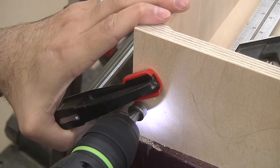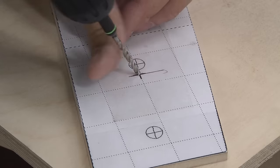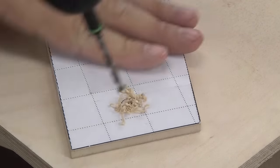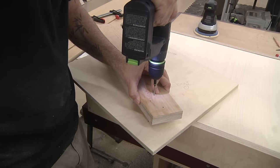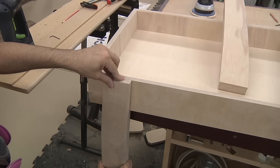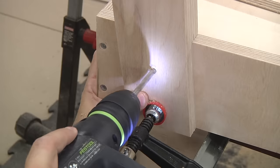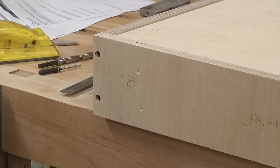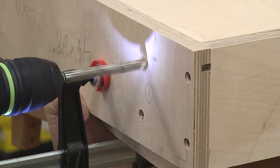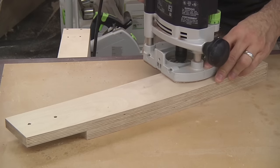Adjust for square and then pre-drill for two screws at each corner. Now let's attach the legs. First, drill a couple of small holes through the template where indicated. Place the template over each leg and transfer the hole locations using the same bit. On the table box, mark two inches in at the top and use that line to locate the legs. The drilling is much easier to do with the whole thing upside down, so flip it and drill the quarter-inch holes through the leg but not completely through the box. Using a larger 3⁄8-inch bit, drill through the starter marks on the box. We'll be using cap nuts that have a larger diameter than our connector bolts. When drilling this hole, clamp a piece of scrap to the inside of the case to help prevent tear-out. Give the legs a nice round-over and see how it looks.